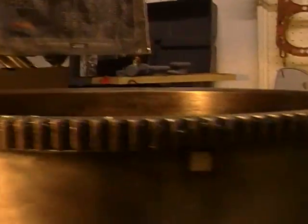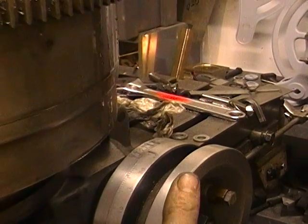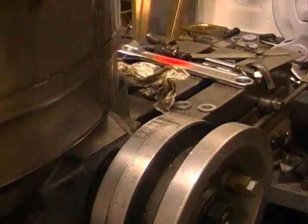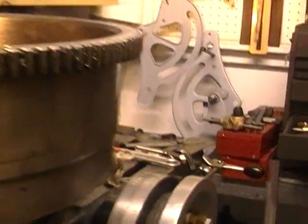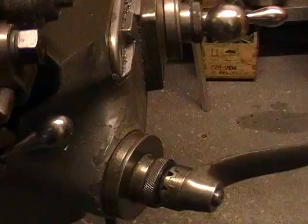Over here I have my indicator zeroed. I'm going two degrees, 41 minutes, and 19.4 seconds. Once that's set with my mark here I can come back. I have a known lift of 150 thousandths on my table. That gives me a lot of control.